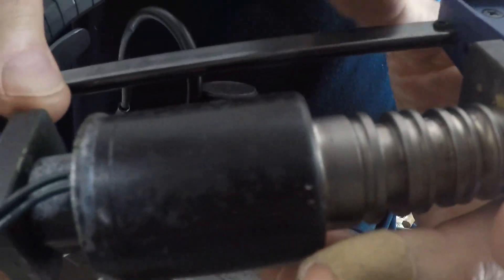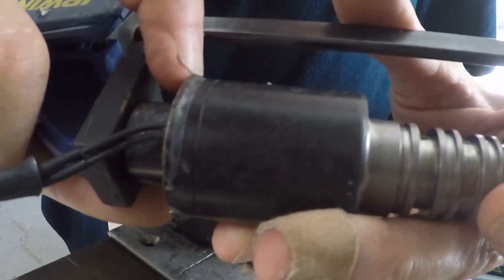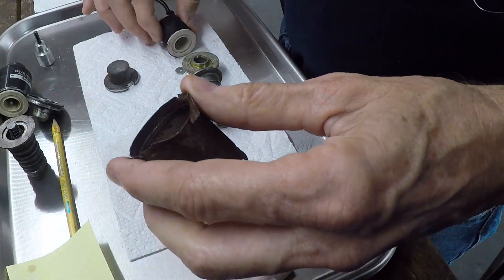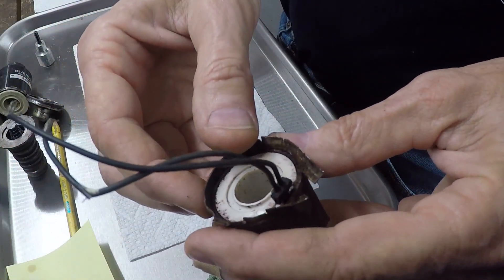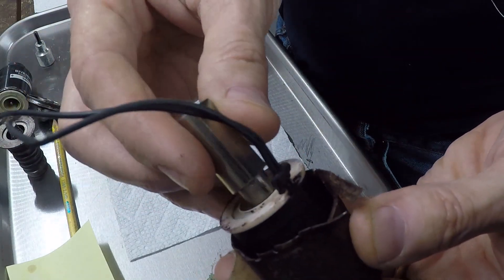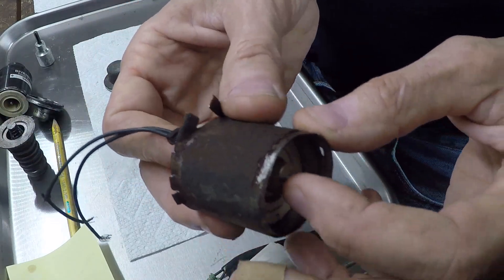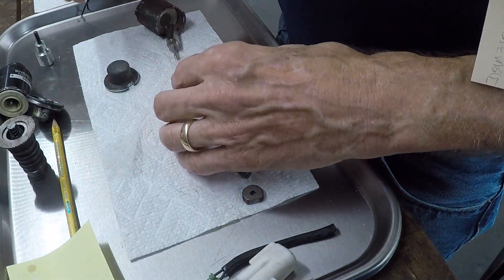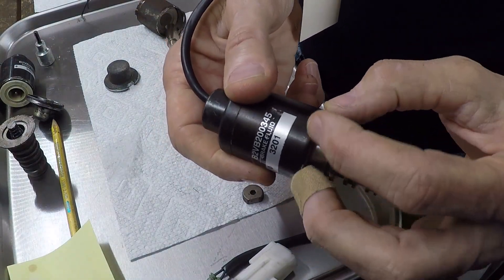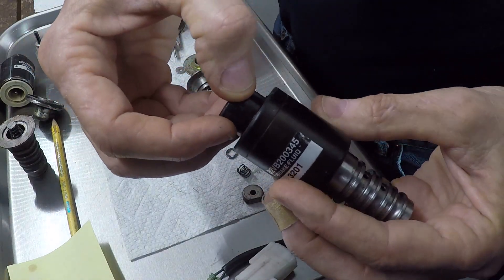Took three or four or five passes. And when I got it done, it now looks like this — it's kind of bent up, kind of turned white where I bent it. So when you take the cap off, this is what's inside: the little coil. And then this is in there — that little plunger floats inside that. The electromagnet moves that, and then the rest of it's buried in the remainder of the canister. Leave this joint alone — I don't think there's any reason to go in there. But if you pry this open, you can get the cap off and get the guts out.